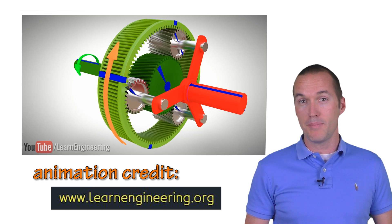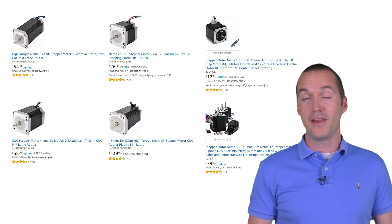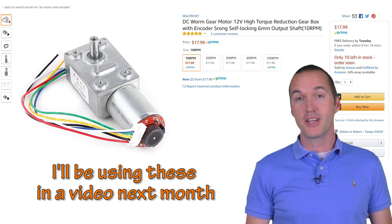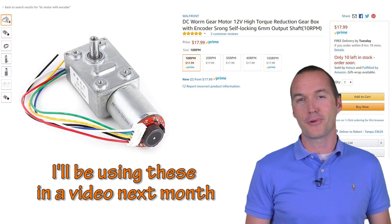The decision to use planetary gears was just as important as the decision to use a stepper motor. Planetary gears allow us to amplify the torque of our stepper motor by a factor of 5. That's important because a less torquey stepper motor will still be able to supply the needed rotational force to roll the shades up and down. It also makes it 5 times more difficult for the weight of the shades to rotate the shaft of the stepper, which helps prevent slippage between steps and when the stepper motor is sleeping. The planetary gear motor worked almost immediately. Another good option would have been a DC motor with a motor encoder, but I really like stepper motors.